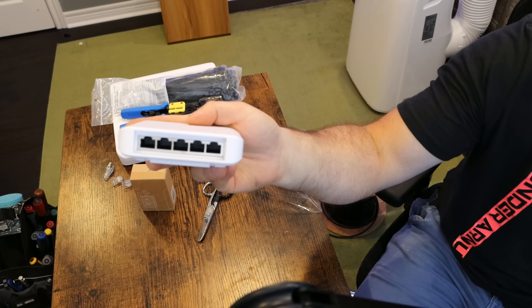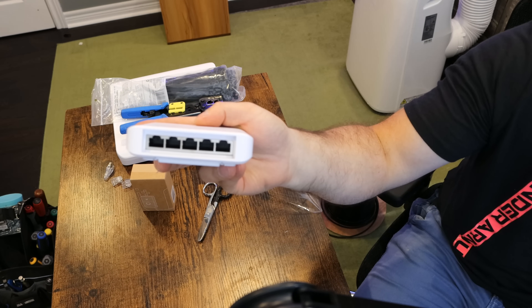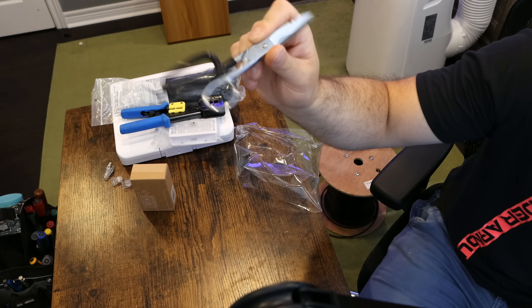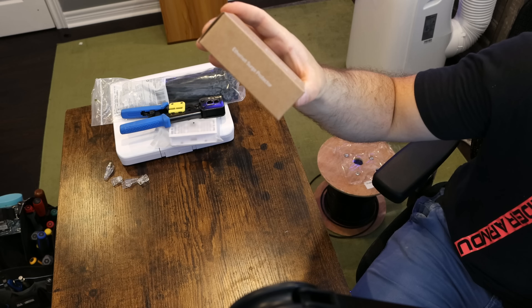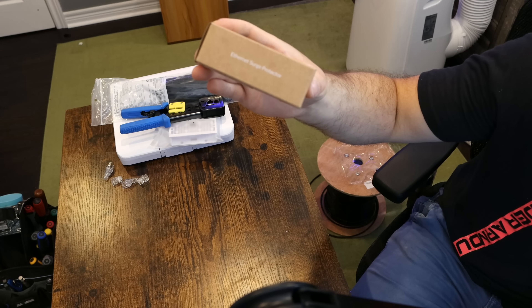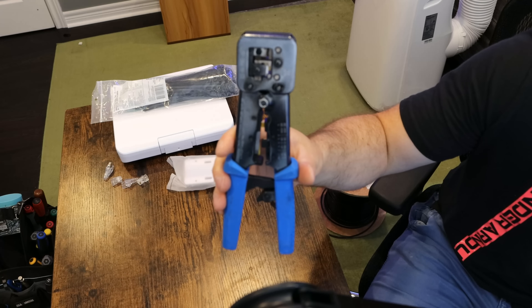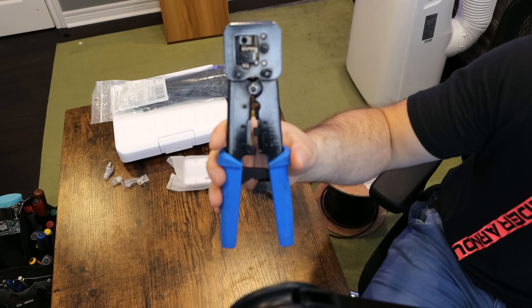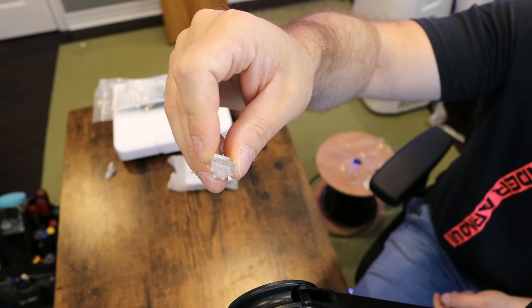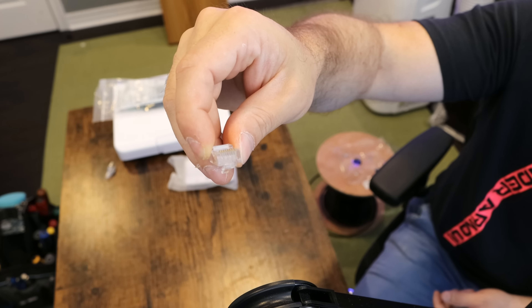Next up is the USW Flex switch. This will be giving the camera power, and we'll be powering this switch from the UniFi Enterprise switch. We have a pair of cable scissors or cable shears — I'll put links in the description below. One thing you should be using is the Ethernet surge protector. We won't be able to use it in this video as I only have one and we need two — I'm waiting for one in the mail — but you should always make sure you have these. We'll be using an RJ45 crimper, and this one is an easy RJ45 crimper where you can use pass-through. We won't be using pass-through ends as we don't want moisture to get on the cable. We have our standard RJ45 ends, and that's what we'll be using to plug into the camera and into our USW Flex switch.